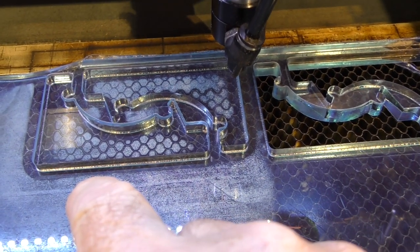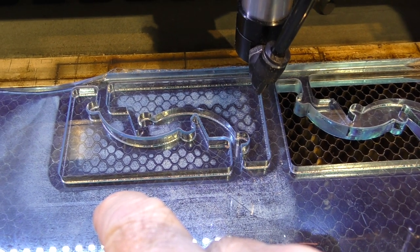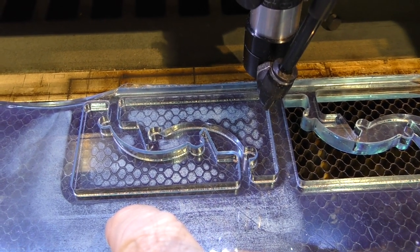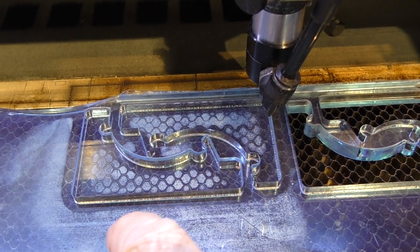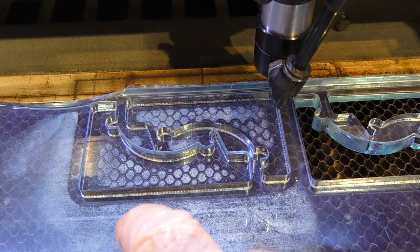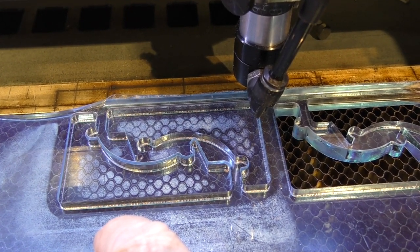This is recondensed acrylic vapour. What you've been watching underneath there is burning acrylic vapour, which builds up in the honeycomb cells. The excess energy from cutting is igniting those fumes that are trapped in the honeycomb cells.